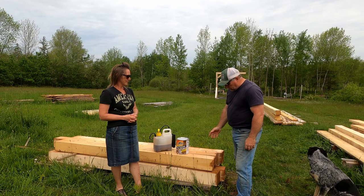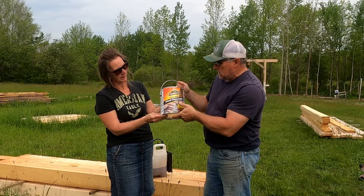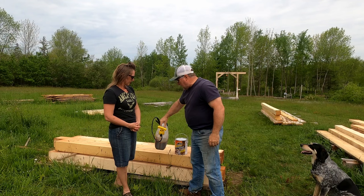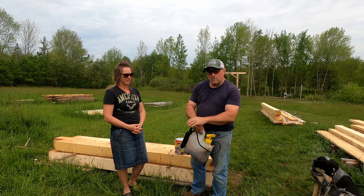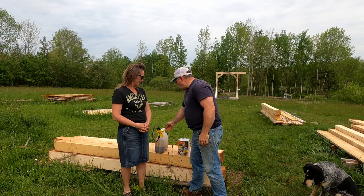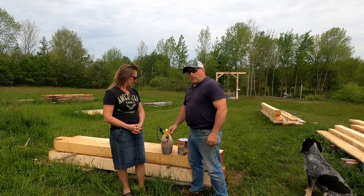So what we use here, and I have had great luck with it, it's a product by Armor All. It's called Wood Preservative Pre-Stain Treatment. You can get this in green pressure treated or the new brown color Sienna pressure treated. It works really well. What we do for application, I have an old sprayer. I just put it in here, pump it up and spray it on. Now it does say on the can not to spray it on — I've always sprayed it on, never had a problem. But always remember to clean the applicator with some Varsol or thinner when you're done so it doesn't clog up.